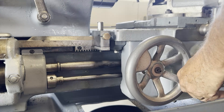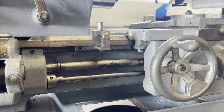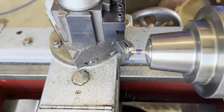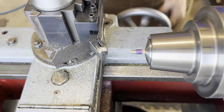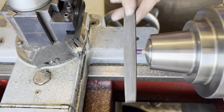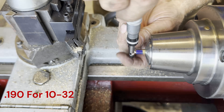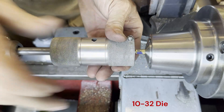This is a lathe stop I made in the shop and it's been really handy. It'll take a dial indicator too, but this doesn't have to be really precise. I just put the stop on there so I don't have to keep judging my depth of cut — I just run it by hand until it bumps the stock and then I stop. Ultimately we're going to run a 10-32 die on this, so 0.190 is what I'm looking for. It took four or five tries before I snuck up on the correct size — I just cut that out for brevity.